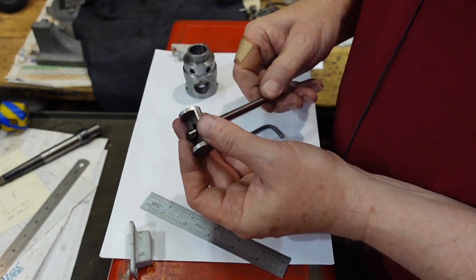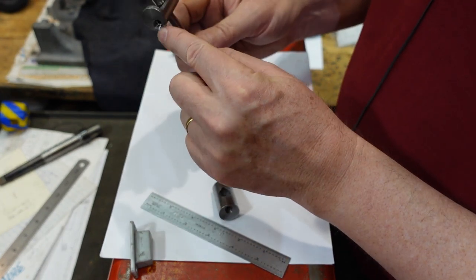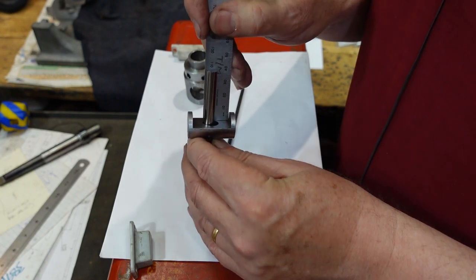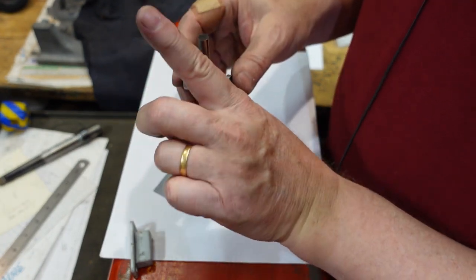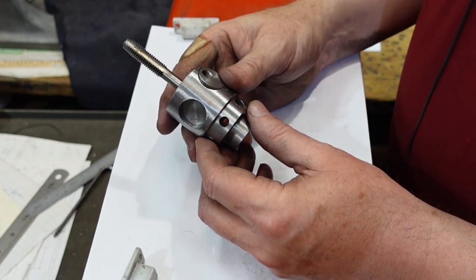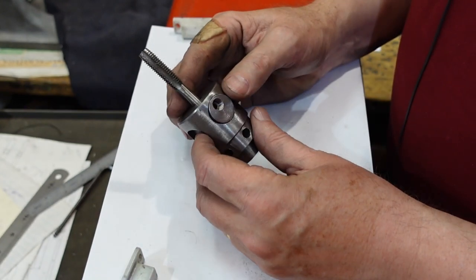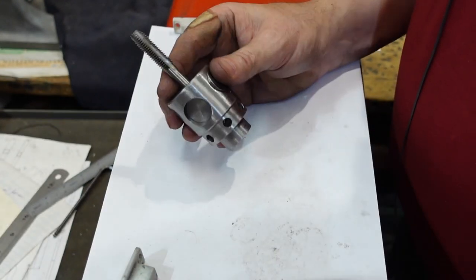What I've now discovered is that my holes here are not where they should be. The V-groove has to be square to this surface, so I'm going to have to do a bit of work with the file to redress those grooves — they need cleaning up anyway. You can just pick up that that's slightly out of square, so this one needs to come this way and go that way a little bit. Other than that it works quite nicely. There's the finish article — it took a lot longer than I thought to deburr it so it moves smoothly and to trim up those V surfaces so that the taps sit square.